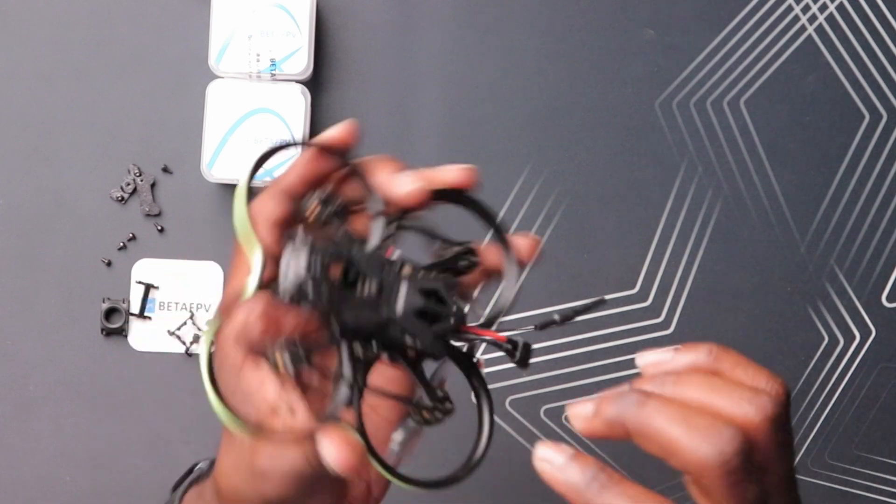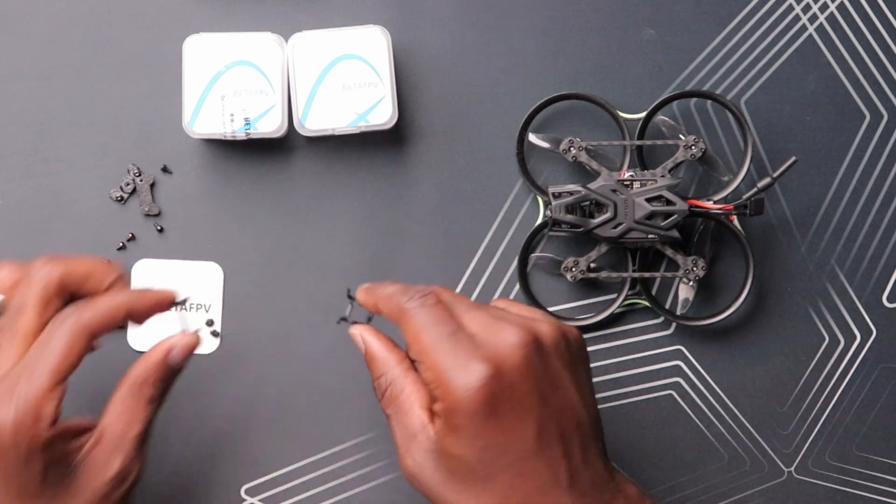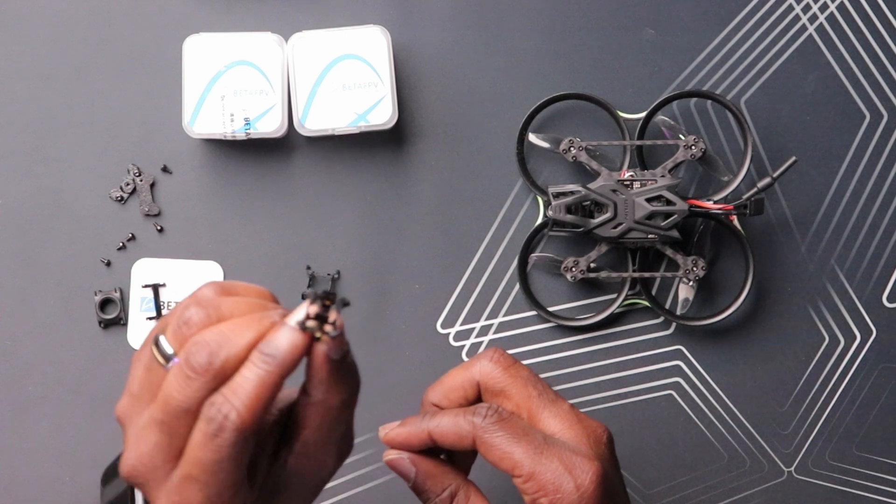Let me know what you think about the image — the image on here was really smooth and jello-free, even though it's kind of bright outside. I did change the actual camera mount on this drone. Although it's the same canopy from the Femto, I went with a newer damping system using spares from Beta FPV — this includes everything to mount an O4 Air Unit camera into a traditional drone, with front and back pieces and small rubber gummies. The stabilization works well in Gyroflow and I was surprised there wasn't much jello in the image.